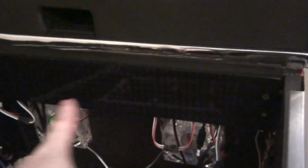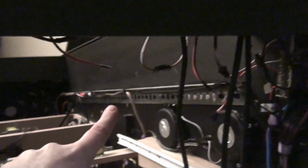And you can see here under the addressable LED panel in the back how this is one small square panel, a bigger middle-sized one, and another small one, and they're all just linked up together. The way I did it this time was, here, I'll come around to the back and open this up. I don't know how well you can see this. It's going to be a mess, but what I did was I had the power come up to this strip for the 5 volts for all the addressable LEDs, and then I just had that tap off into each of the main matrices. The one going down there, the one going down there, and the one up here. It's all tapped into each one directly.